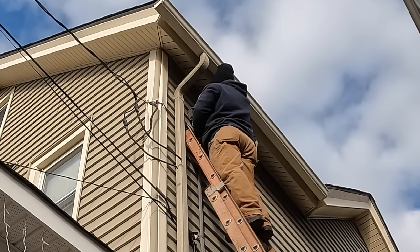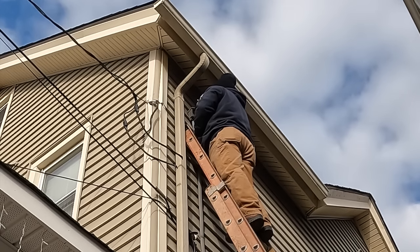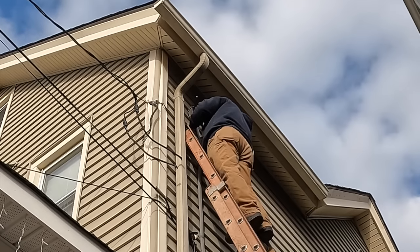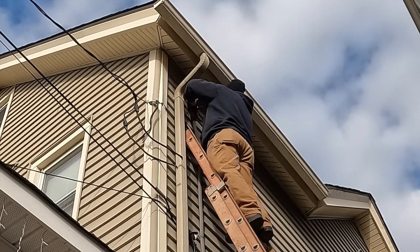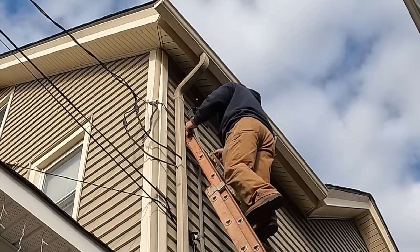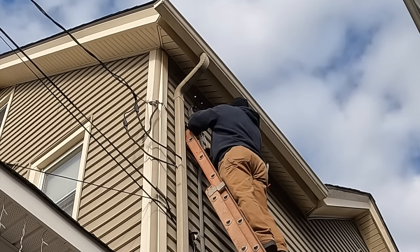But you'll see at the end of this video, if my camera battery didn't die, that after I tie in, I get 120 volts from each leg to ground, but I get 208 volts across both legs. So this is not a 120/240 volt service, and I'm not sure if JCP&L is aware of that. I can't speak on their behalf.